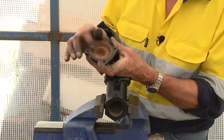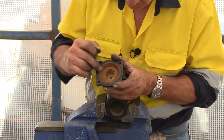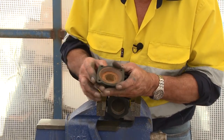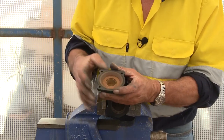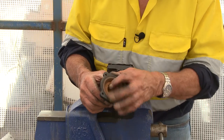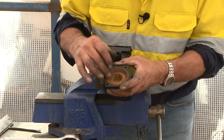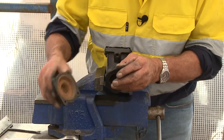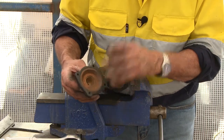The housing itself is corroded slightly - well, it's cast, so of course it's susceptible to corrosion. Is it of any consequence? Not really, because it's only mild surface rust and it hasn't undermined the integrity of the housing. If there were scale rust in there it'd be a different story - then I'd check whether it had undermined the sealing surfaces. In this case, with just a little bit of corrosion, I'd give it a clean-up with some wet and dry or a wire brush and wipe a little bit of alkyd primer on there - or even a bit of grease will do the same thing.